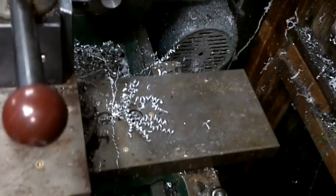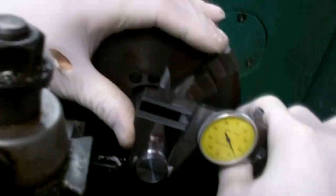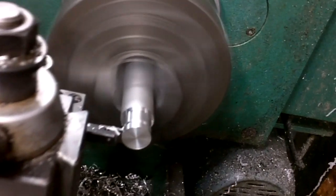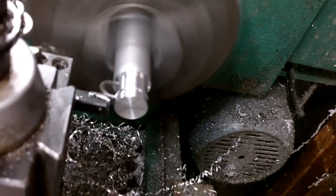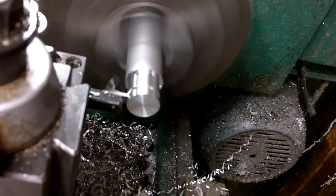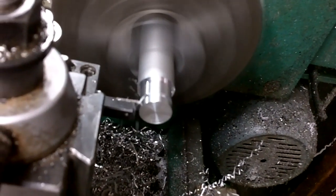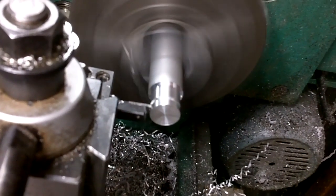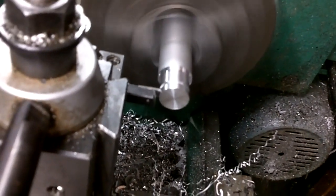These are the chaser bottle adapters. Right here I'm going to show how one is made from raw aluminum — this is done on a manual lathe. Precision is key. Always measure twice, cut once. For all those who wonder what exactly is a lathe, this is a lathe right here. What I'm using right there is a parting tool, often used to cut O-ring glands. Two O-ring glands. That's a finished part cut off.